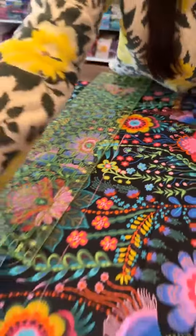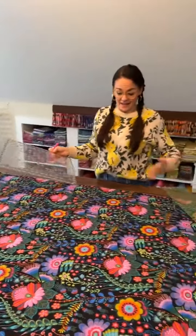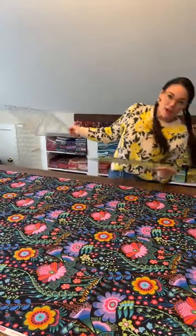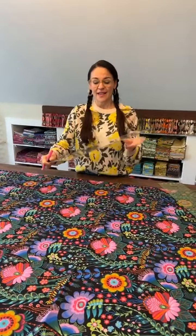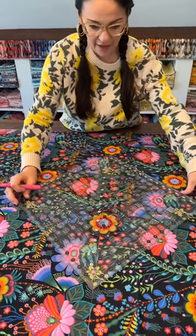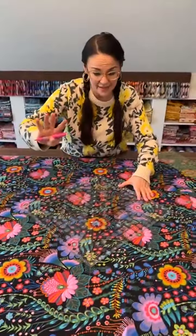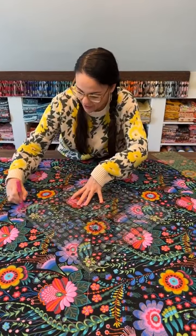I've got a 29-inch line going in a perpendicular direction, and it's the end of those points that gives me that angle — the starting and the ending point for my angle. This grid — and hopefully one that you have in your possession as well — has a 45-degree line down the middle of it, and to begin my angled line I'm going to lay that 45-degree angle line right on top of my chalk line with the ending point at that other little mark that I made — that's my 29 inches. That gets me on the right angle to start that line. Now I'm marking my angled line, just a portion of it.